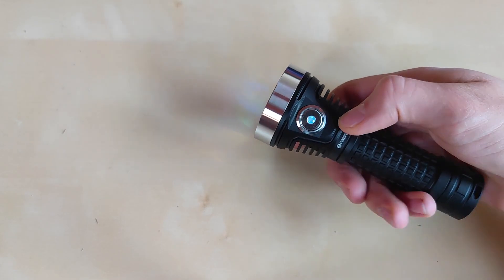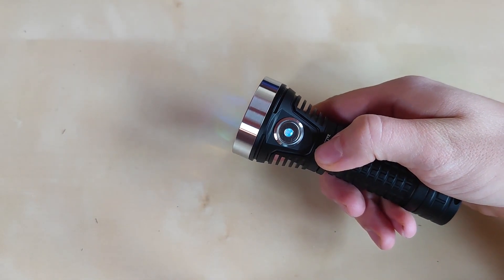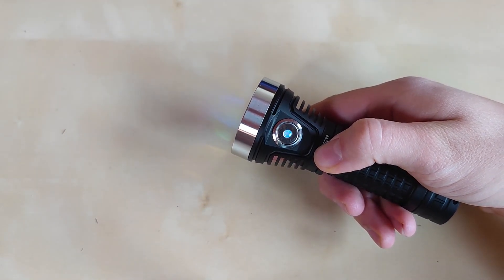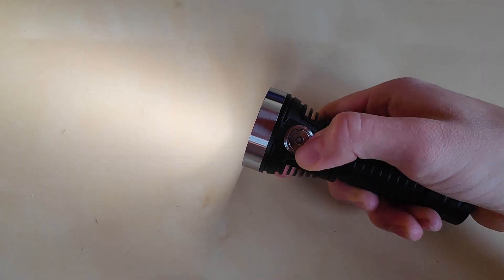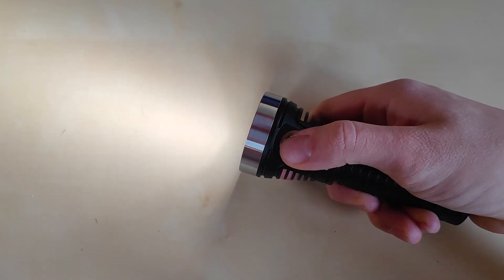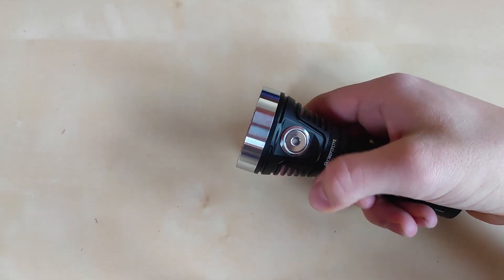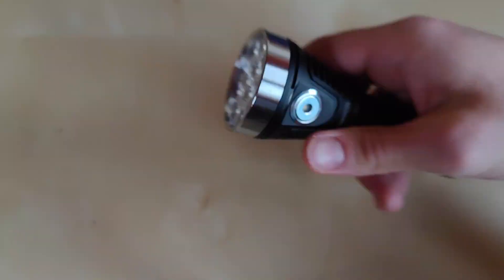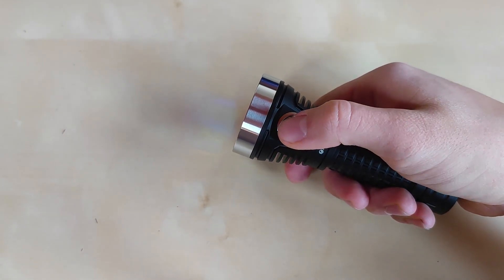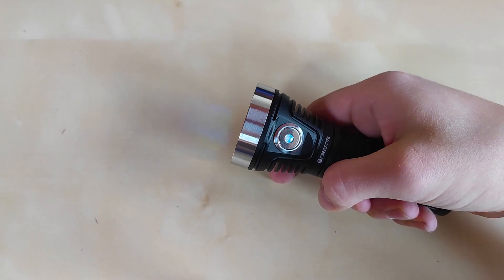Here I'll just cover the basic functions. One click for on, one click for off. The switch is linked to the auxiliary LEDs. You can change the brightness via seven clicks from off. If you are in the on position, hold the switch to increase then decrease the brightness. You can also set modes or smooth ramping — one to three clicks to toggle between smooth ramping and set modes. When the flashlight is off, hold the switch to enter the lowest moonlight setting, which is quite low thanks to the linear driver. Double tap to access the highest available mode — max ramp from off.